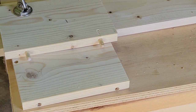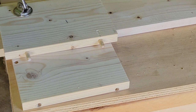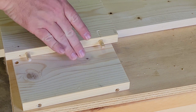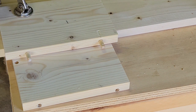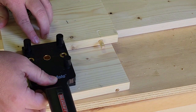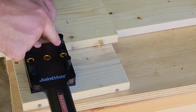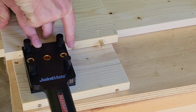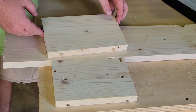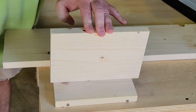For surface joints, you do steps one through six of making the corner joint. Then you get board two and draw a line where your holes need to be. Take your jig, put it over the right dowel — there's a center line on it — line that up with the line on your board, and just drill your holes, and repeat on down. Went ahead and drilled my holes. Let's see how it fits. There we go.